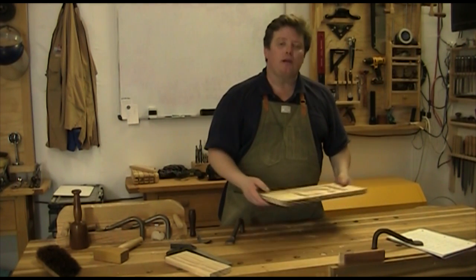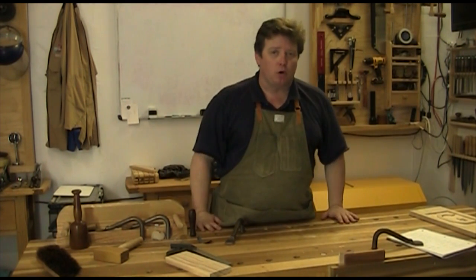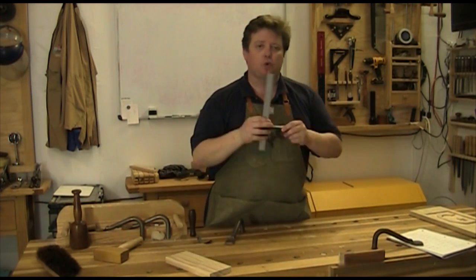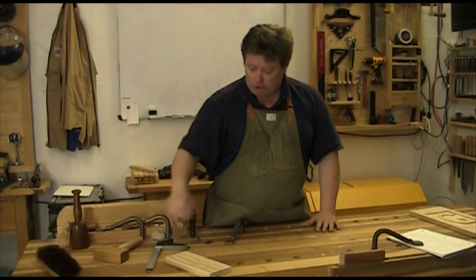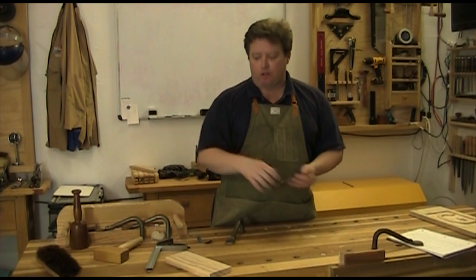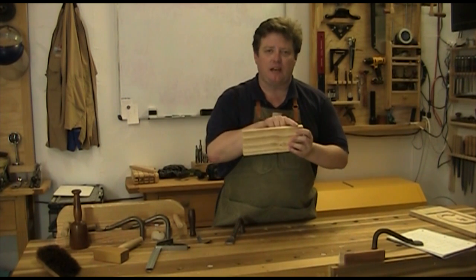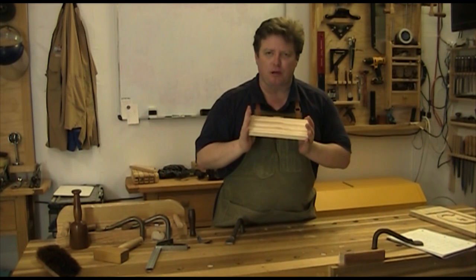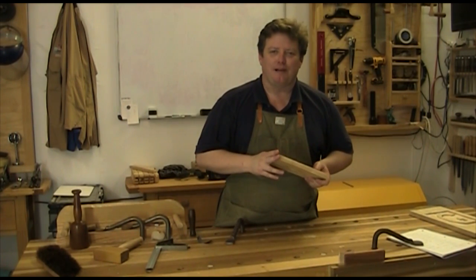In our next episode, we're going to do part 3, the final of this introductory woodworking episode, and we're going to use all the same tools, all the same clamps that you use, but we're going to add one item. We're going to add a square and a ruler because we're going to use precise measurements to make some cuts. And using just the chisel and mallet, I'm going to introduce you to some basic joinery techniques. The material you're going to be using is a 3-inch by 7-inch board, and it can be the same 3/4 material. That's not as important, but the size is pretty important. So come to the next lesson, the next episode, with your materials ready.